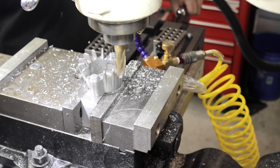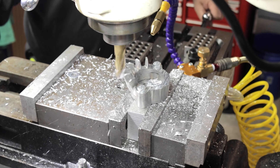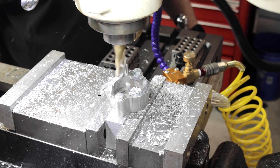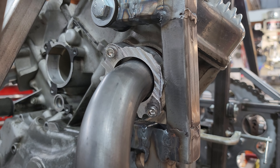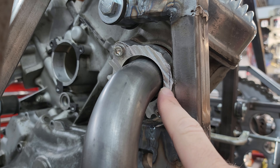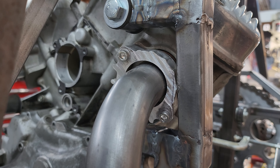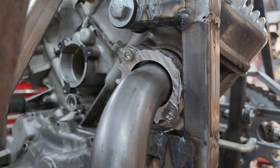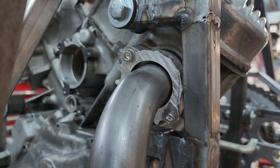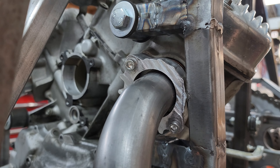The stock CX500 exhaust flange did not fit on the left side, so I milled off the fins of the flange. To make sure both sides match, I did the same on the right side, making a small mounting fixture for them. However, another problem came up: on the left side, there's not quite enough room — the flange hits the frame. That's because I didn't do super accurate 3D models of those particular parts. I'm probably going to be custom-making specific flanges with 3D CNC later, but for now I'm just going to shave off that part on my milling machine.